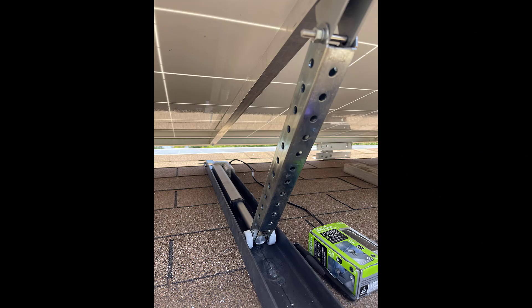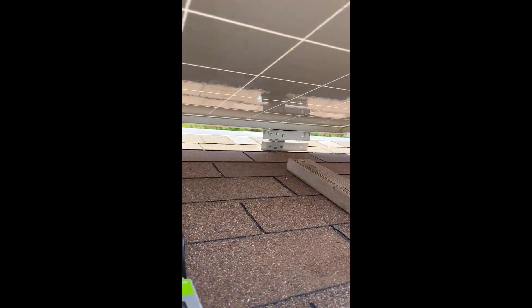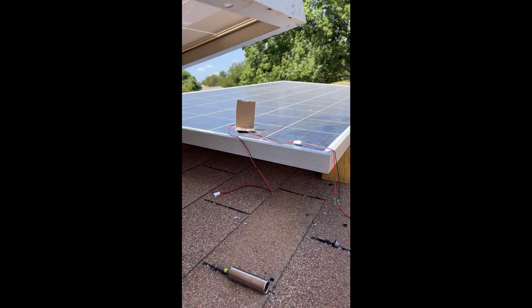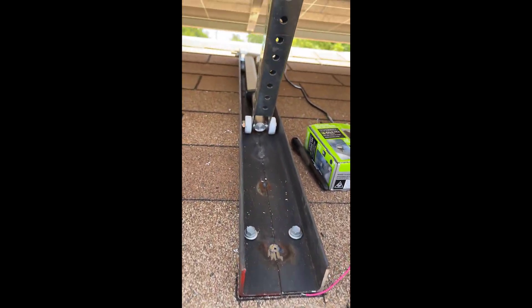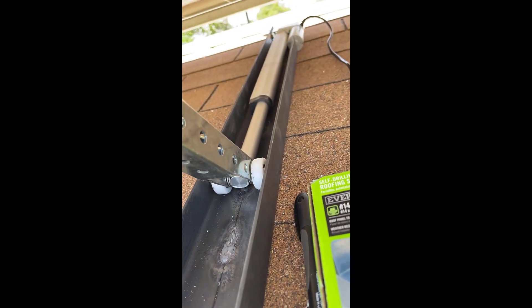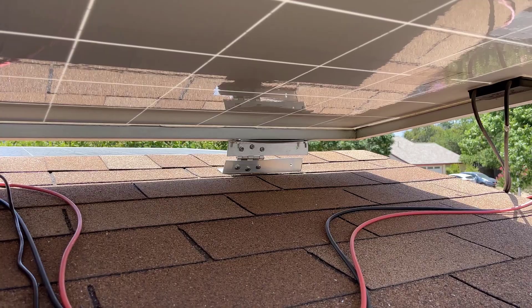This is the vertical mount — it rides along the tray there. When it runs out, it's a 12-inch actuator that pushes the bar up and rides on those bearings within the trough. I had an issue with the other side: the articulated bar with holes in it is 16 inches on that side. I dropped it to 14 inches on this side, which increases the starting angle and puts a lot less pressure on the hinges in the back.